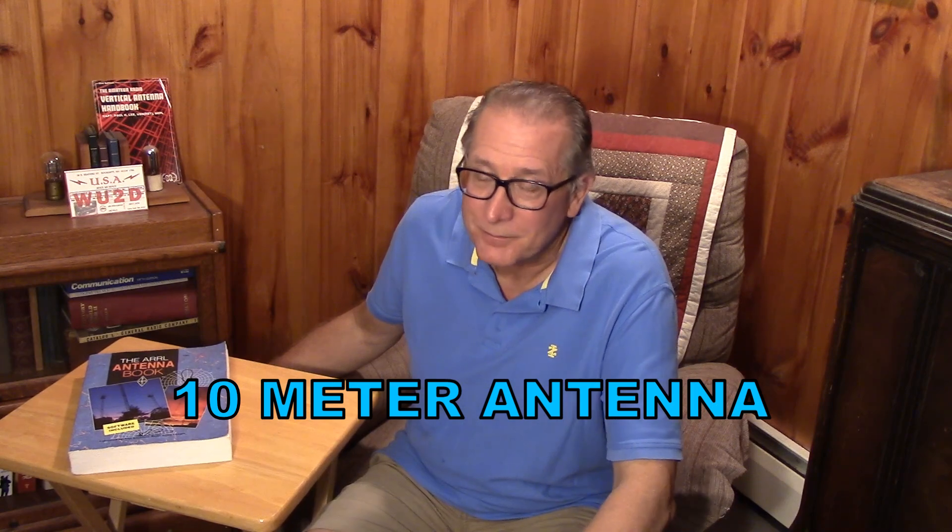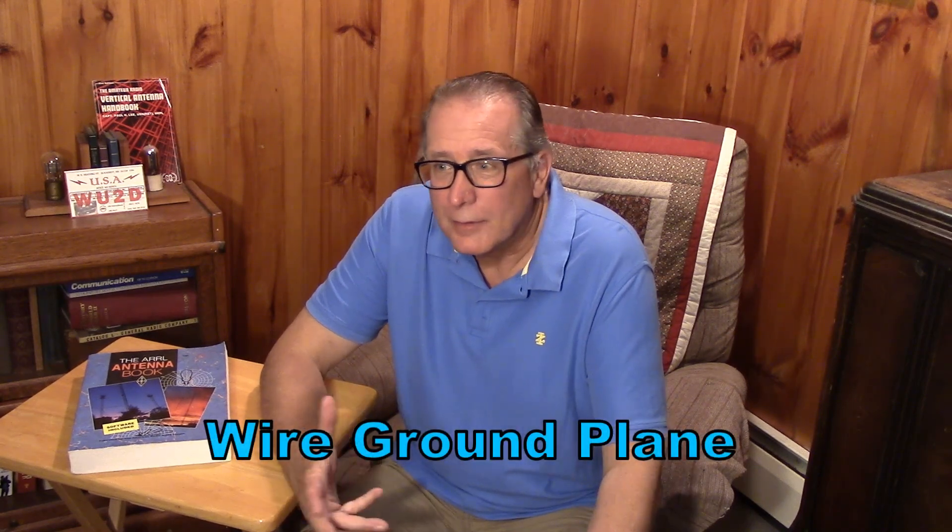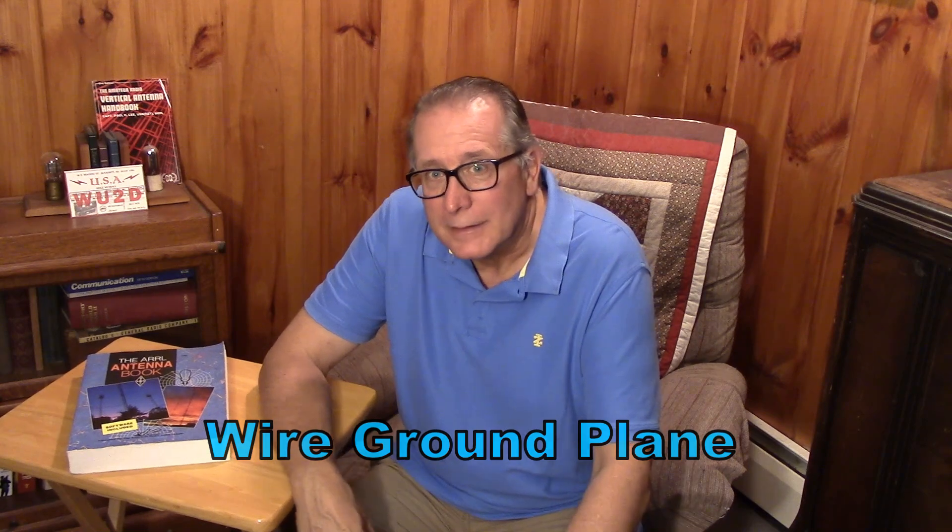But we're going to need an antenna. First I thought of the old-fashioned ground plane antenna. This is really just made out of three, four, five pieces of quarter wave wire — you suspend it in the air, feed it with coax, and it's a wonderful low angle radiating antenna on 10 meters. I've also built five-eighths waves. Those are great antennas on 10.